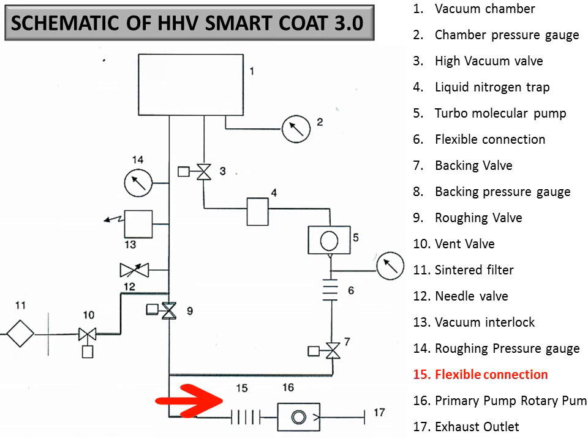Now we can come to 10. If you have done all the methods, all the deposition and all, then 10 is nothing but a direct connection from the chamber to the environment. So the main thing is 16. 16 is numbered last, but it is the most important part of the system, because this is the rotary pump, the primary rotary pump for the turbo, which is used initially.